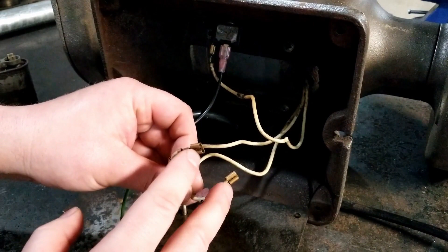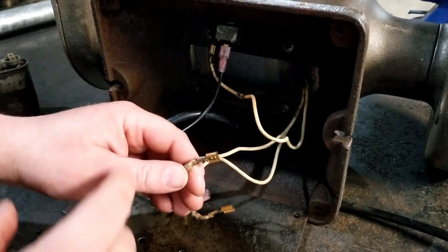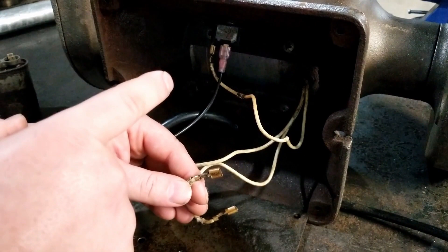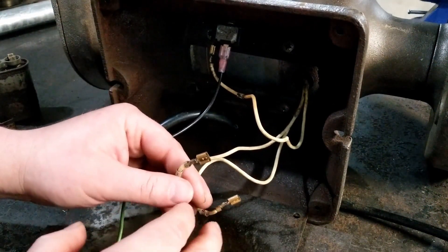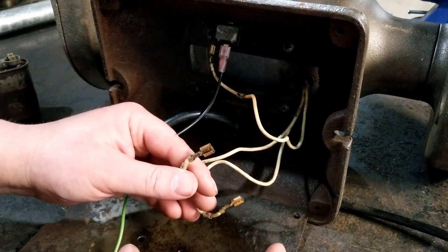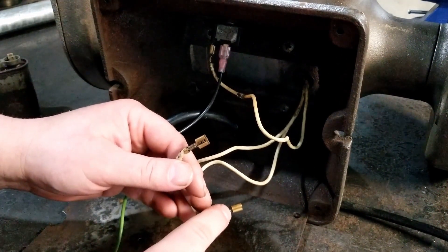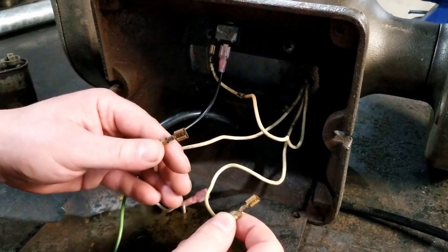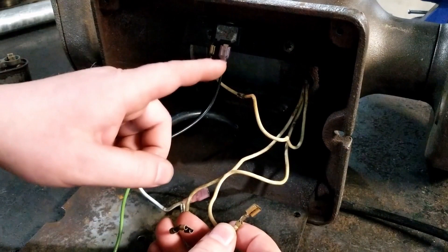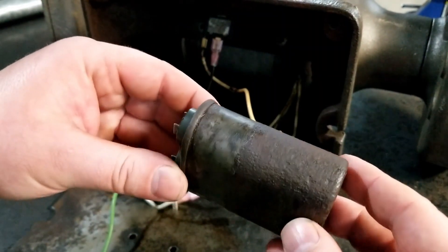The capacitor joins between the two coils and one connects to the neutral. What the capacitor does is split the phase — houses in the US only have single phase. The more phases you have on an electric motor, the more efficient it'll work. When that capacitor is wired in, it splits into a second phase, causing a 90-degree phase shift. With a shorted capacitor that reads two ohms and has no capacitance, that circuit is still energized but probably drawing way too much current.